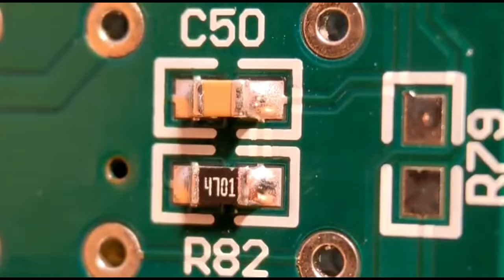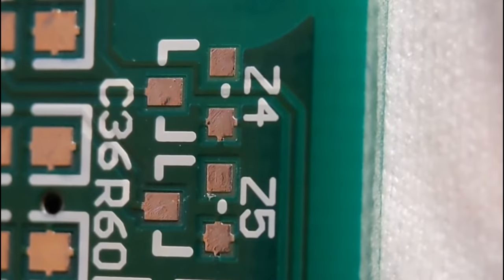You've got four nice joints, nice and central. If you can get these joints not bulbous, they really help you when you get to the smaller 0402s and your fine-pitch ICs. I'll put photos up at the end, then move on to the other components.